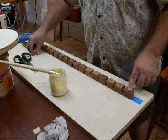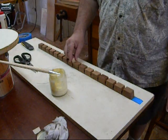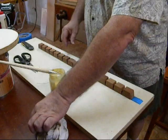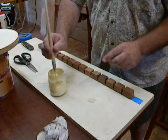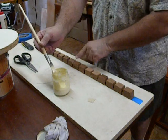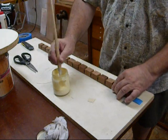What we're going to do is midway — there's 16 blocks, so at number eight — we're going to put a little shim in here, like so. You could use a piece of card stock. This is some edge banding veneer I have laying around. We won't glue up either end or in the center, but the rest of it will get glued up, just like we started out.